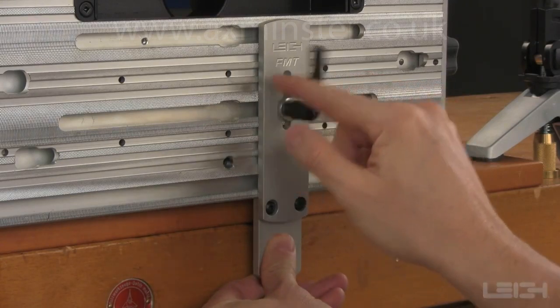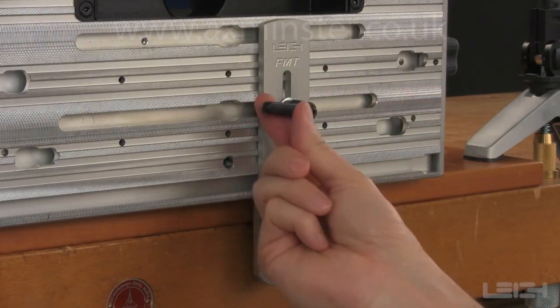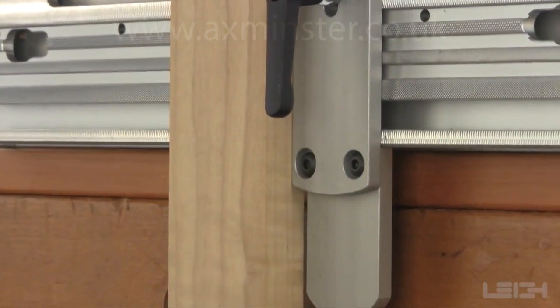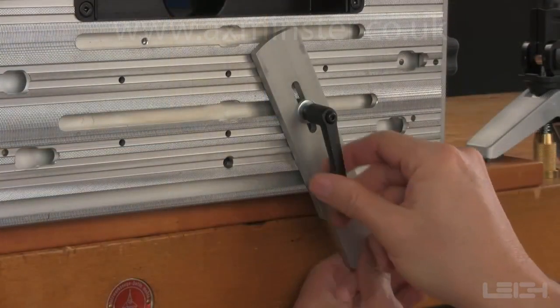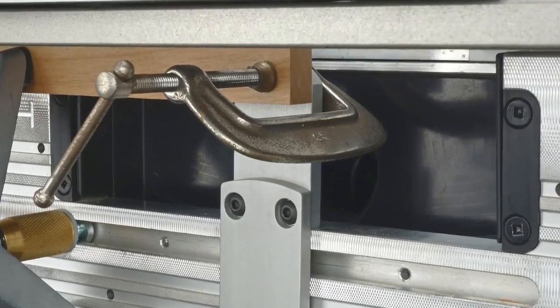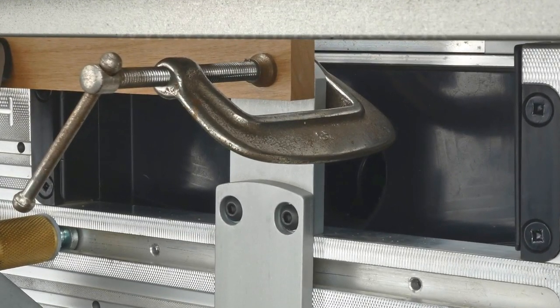The adjustable side stop fence provides accurate tenon workpiece positioning. The short end acts as a T-square against the clamp plate edge. It can be set up to 45 degrees for routing angled joints. It also provides additional support when routing smaller mortise workpieces.